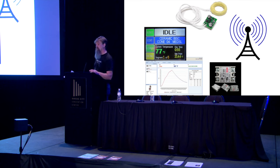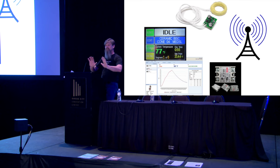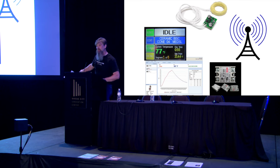We succeeded by just having her rate of climb change from 9999 to just 999. The kiln still drops at its normal rate. It's still going to drop 1,000 degrees an hour? No, but it's still going to drop at its normal rate. It just says, hey, whoa, slow down, put the brakes on as you get closer. So that's an example of taking the data that we're learning and applying it to change how our kilns work.